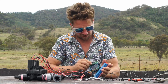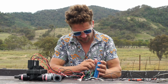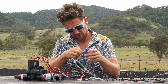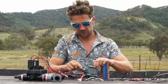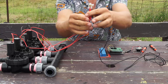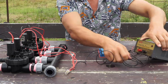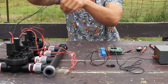Now I'm going to connect pin 0 to relay 1, 1 to 2, 2 to 3, and 3 to 4. You also need to connect the 5-volt power from the Arduino into the VCC terminal of the relay, and ground to ground. The nine-volt battery will be the power source for the Arduino. All the solenoids' red cables come into one connector, making it easy to then get some distance to the safe spot into the black side of the power source.